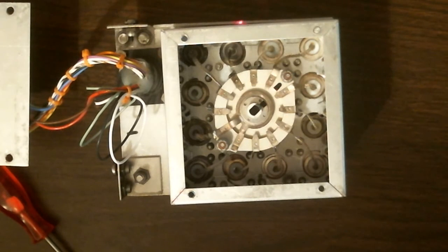A piece of braid goes from the top connector down to the bottom wafer, and from there to the output connector. Why braid? Because I don't like to use solid number-12 bus wire. Sooner or later it gets hot and pushes, then gets cold and pulls. Push-pull a few times and it's going to break something or make a bad connection. Braid doesn't do that — it's flexible and will stay there forever.